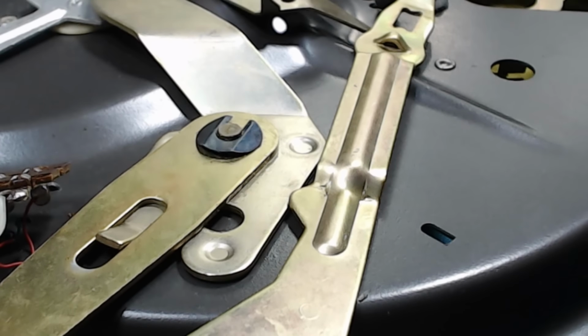Put him face down. Now here's the cam, or the arm control cam, whatever you want to call it. Garrard, just call it a cam. Bit of grease in there. This trip pull, I'll put the tiniest drop of oil in this little bearing there, and that's all. That needs to be absolutely loose. All right. I'll put a drop of oil on the shaft here. That'll do it. And some in this cam follower. A little bit of oil in there.